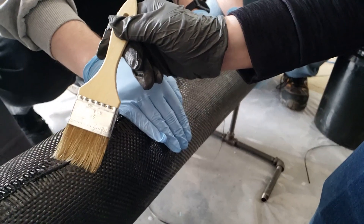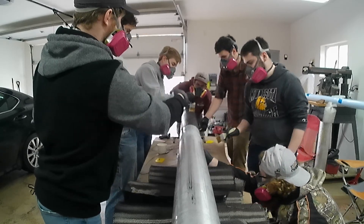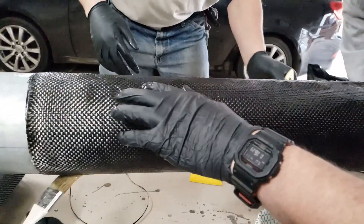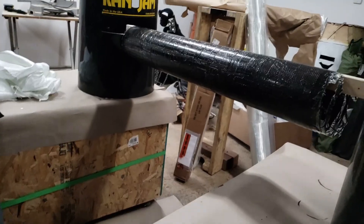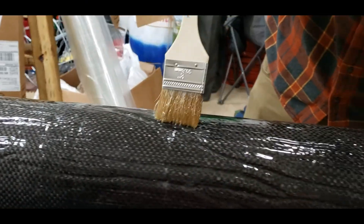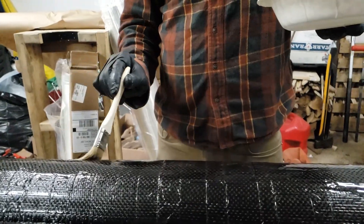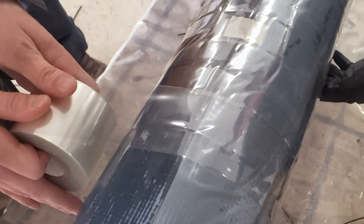The carbon fiber sections of our rocket were made using a 6-12K weave, with the 12K strands of fiber running along the axis of the rocket to ensure it maintained enough strength and rigidity when the rocket was undergoing a bending moment. We used a 60 to 40 resin to fiber ratio to ensure that enough fiber was thoroughly coated and no dry spots would occur. We also scraped and applied enough compression to ensure there were no pockets of excess resin that would lead to deformations.